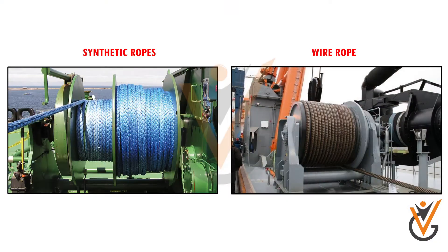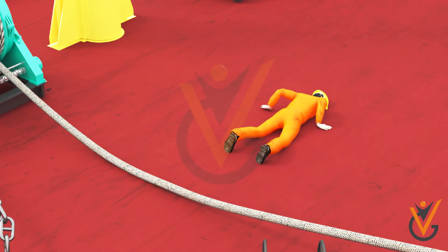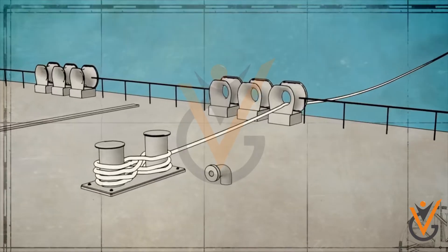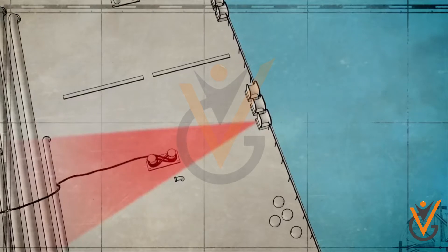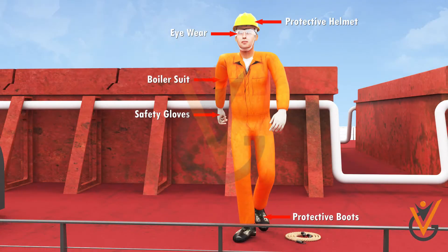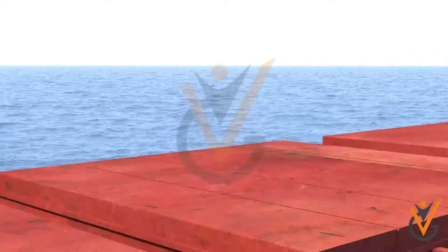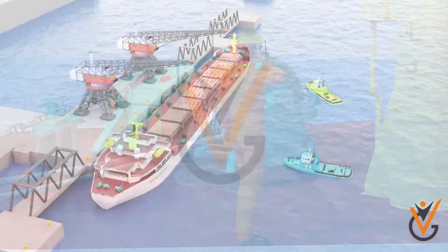When handling mooring wires, a thicker messenger line called a gat line is used. Whenever synthetic ropes and wires are being used, care should be taken to ensure that ship staff do not get their legs fouled with the rope. Similarly, precaution should be taken when tightening ropes to ensure that the crew does not get hurt when ropes part. Since polypropylene ropes and wire do not give any warning before they part, all crew should be wearing proper safety gear.